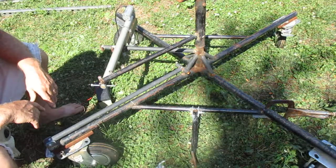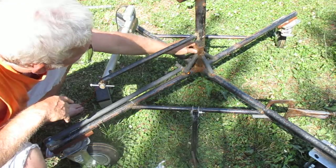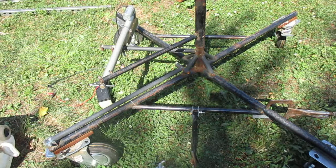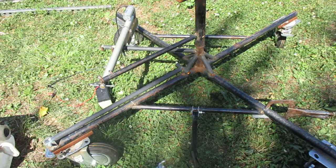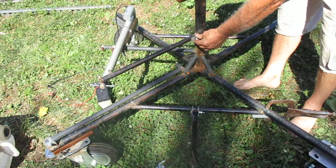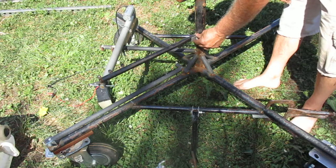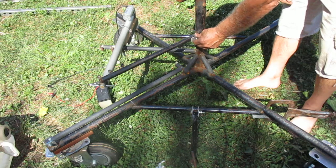And I think I'm gonna put some reinforcement for this rotation assembly bar and this one down here too. So what I think I'll do is just take a steel drop, kind of just weld it on there like that. Gives a little extra strength. Like I say, you'd be surprised at the degree of torque this assembly is going to go through, so there's no way you can over-engineer it. Mr. Wind wants to, he'll pick his whole thing up and throw it in the next county and he won't care.